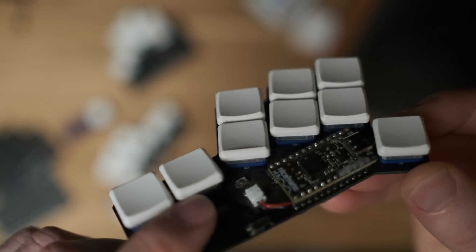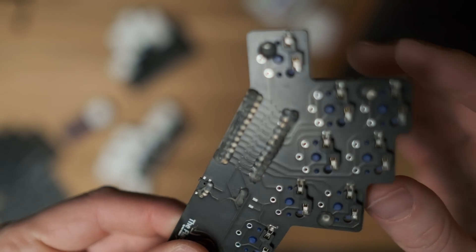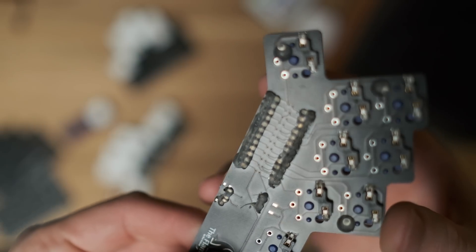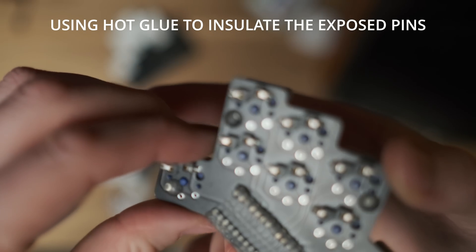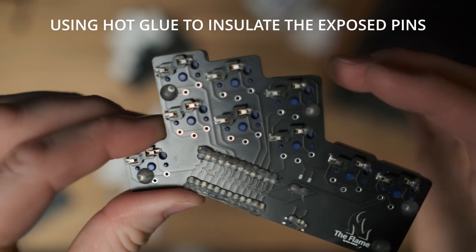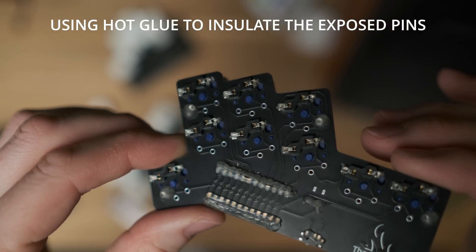It's worth mentioning another issue I had when experimenting with the split keyboard as a portable keyboard — I kept short circuiting them in my pockets, which was extraordinary. I couldn't figure out what was going on; I turned them off and couldn't see how any shorting was happening. But there are pins that can still cause problems if you short them out, because you can connect the live output from the battery to those pins even if the switch is turned off. Of course, if the board was in a proper case this wouldn't happen. I haven't built a 3D printed case for these keyboards yet, but for this portable one that would be a really good idea.